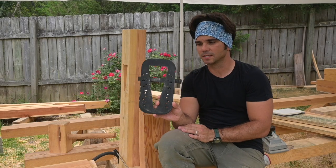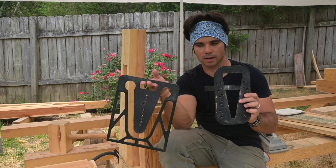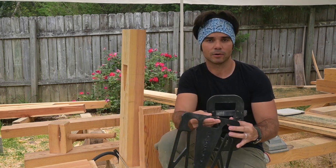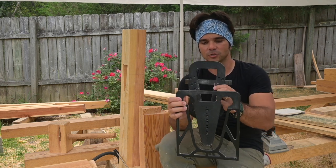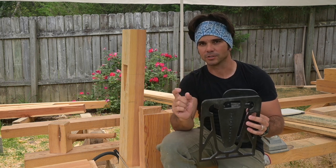This is one of the jigs. This is the mortising jig. And here is your tenon jig. So these two go together. They are tuned to use exactly the router bit that I have in the description. So there's a router bit and a bearing combination that needs to be used simultaneously to use this jig. And the reason is that there's an offset between these two that matches that router and bearing combination precisely.